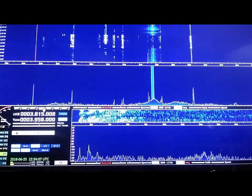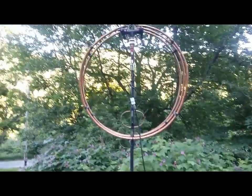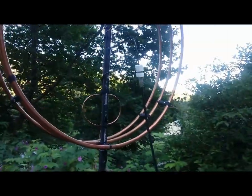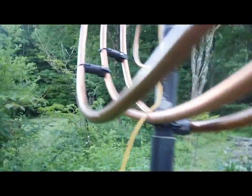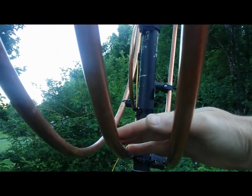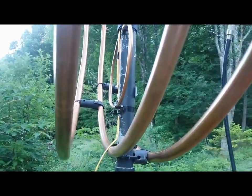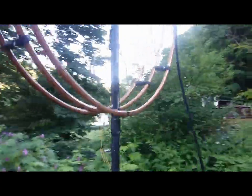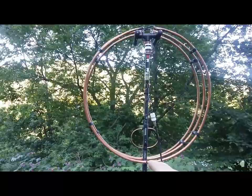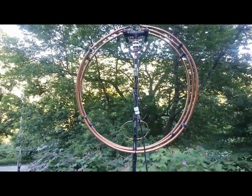Okay, we'll get outside and show you what's going on. Hey, there she blows! What I have are three loops on here — it's for 80 meters and 75 meters. What I can do is flip this over to this side if I'm running on 40 meters, so it puts this right smack in the middle, and I found this helps a lot. I can turn this around and bring the loop from this side over to this side — it tends to equalize things. I'll be flipping this over completely, basically putting the capacitor and everything on the bottom.